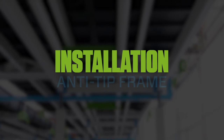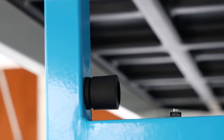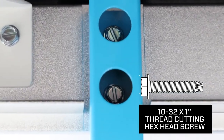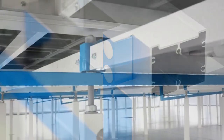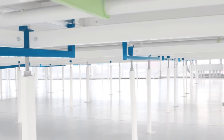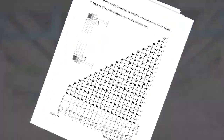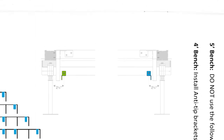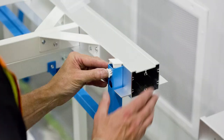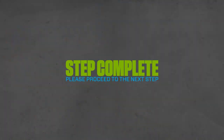Step 8: Installation of anti-tip frame. Pre-assemble all anti-tip frames with bump stops. The anti-tip frame connects to the center table extrusions via four hex head screws. The screws are covered with hole plugs to prevent debris or excess condensation from entering the tube. 5-foot benches require anti-tip brackets at every arch location, while 4-foot benches require installation at various arches based on total table length — refer to the chart in your manual. Guide bracket orientation changes based on arch number and total table length; failure to install correctly will result in table drift and damage over time. After anti-tip frame installation, install guide brackets using a self-drilling screw 2-3/4 inches inset from the blue frame connector.